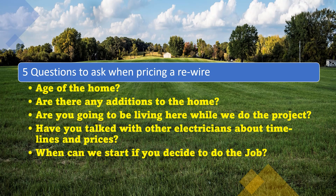Maybe there's going to be asbestos present. The second question is: are there any additions to the home? This can get really sticky because a home might look like one solid piece, but you go to rewire and there are three different additions — sometimes three different crawl spaces and three different attic partitions. During the estimate you might easily see the basement or crawl space partitions, but you might not be able to see all the places where the attic is cut off. You might have to get in the attic and physically cut a hole to get into the next section — I've done it many times, cut through a roof buried under another roof from an addition. So if there are any additions, it adds time, labor, effort, and hassle.